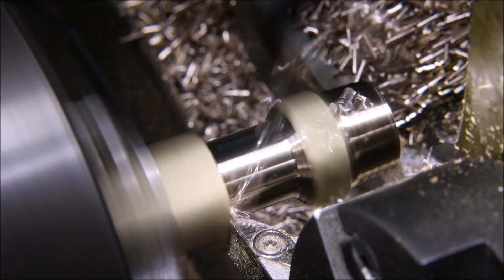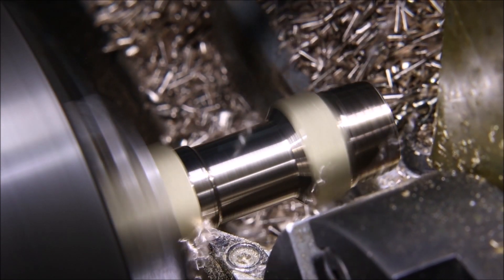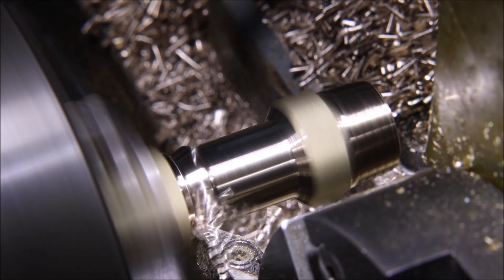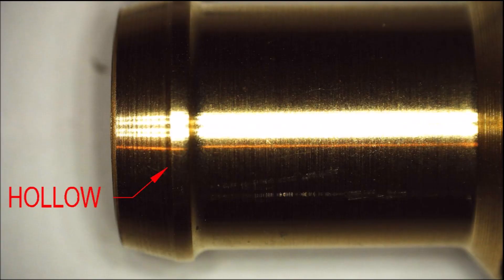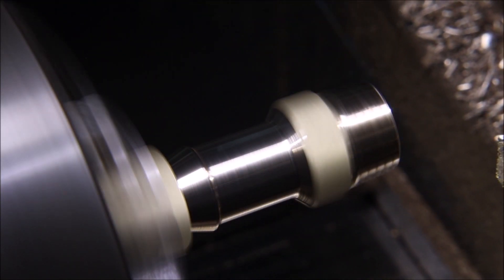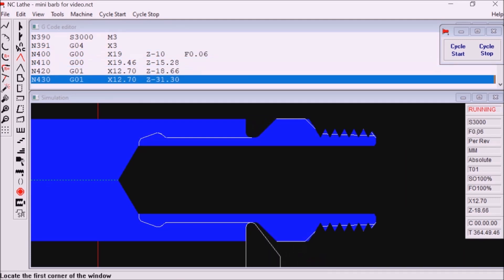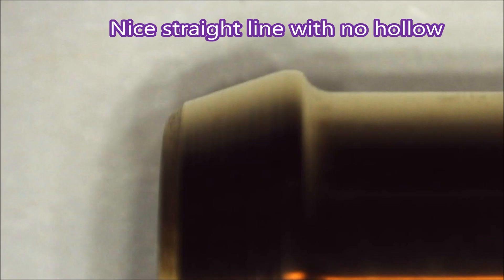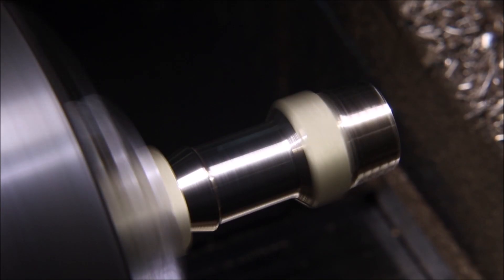You can see it's cutting quite nicely. I've slowed it down just there so you can see what's going on — that's turning parallel, and then that's putting the long chamfer on the barb. When I had the machine just following the contour, this is what happened — it was leaving a lip. I think all I'm doing by making the tool do a little dance is removing any backlash in the system, and this is how the parts turned out with the program as written.